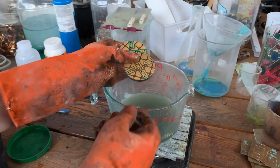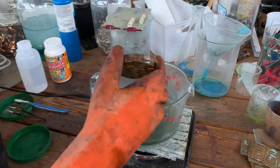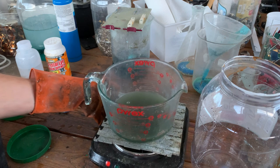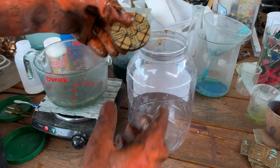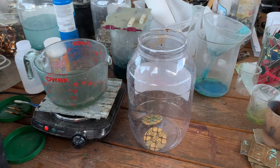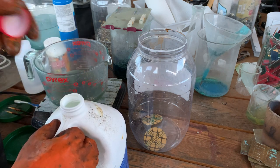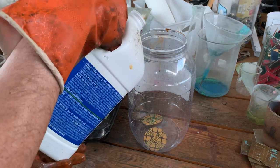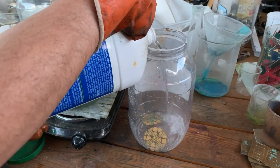Now that we've got our two medallions, we're going to grab our containers and move the lye bath over. We'll drop these two into the container and add some hydrochloric — muriatic acid — just barely covering them. We want to create some copper chloride that will eat away the layer holding the gold panels down.